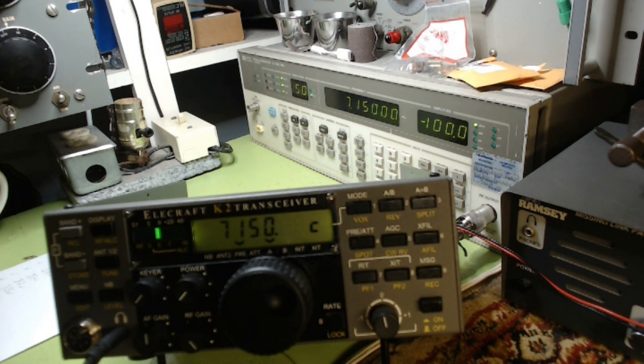It's really straightforward in the book. If anybody's building one of these, you're doing this stuff anyway, and lots of people have built these before me and didn't videotape it. I did the BFO alignment, which is all about setting internal filters — setting all the filters up, the BFO test, the calibration of the BFO range — all done in the BFO alignment. It all has to do with the filters; it's all internal.